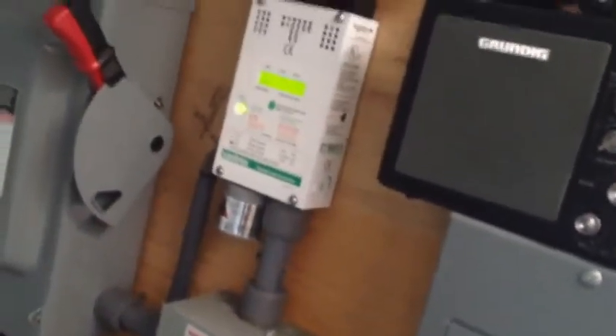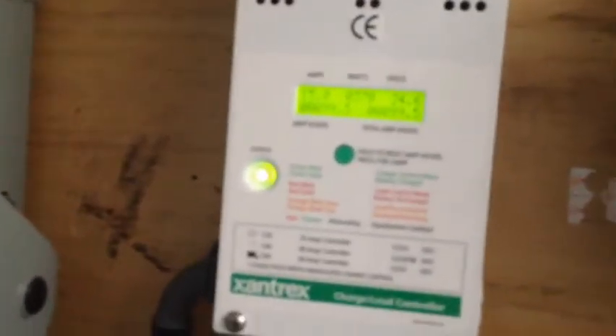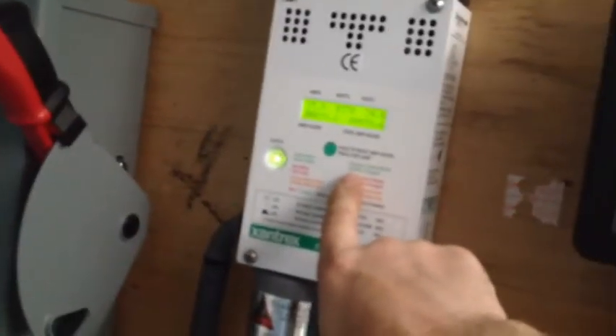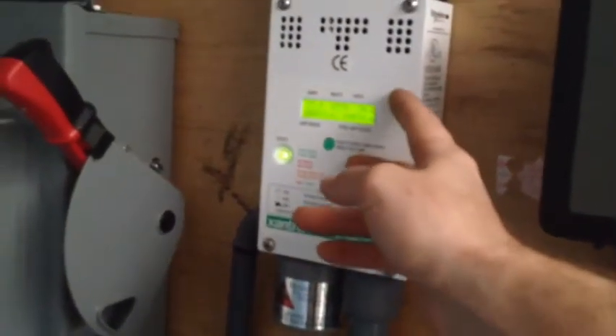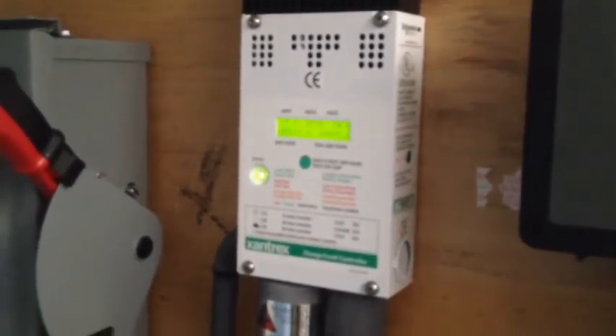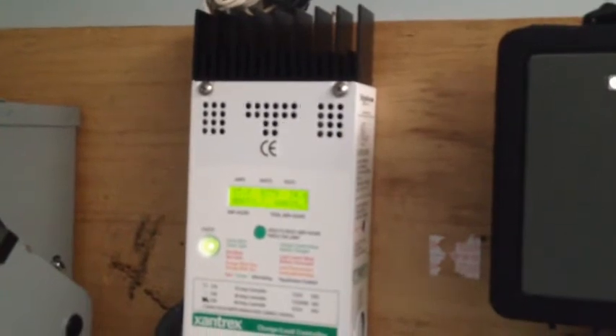You can hear the inverter — it's noisy whether there's anything hooked up to it or not; when it's on, it's just noisy. So I'll try to cancel some of that noise. It's really running quite well. This light being on indicates a solid battery charge state. As soon as I bring the weight off the inverter — because it's load compensating for the inverter right now — it'll start to bring the batteries right back up to their float value. While under load, it's doing more work to compensate for what the inverter is providing to the AC circuit. The battery is kind of just ignored at this point, but it does get right up there to 29 volts quite fast without any weight on the inverter.